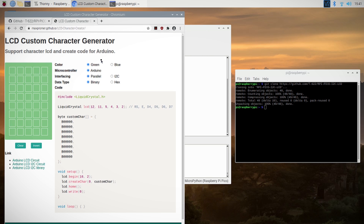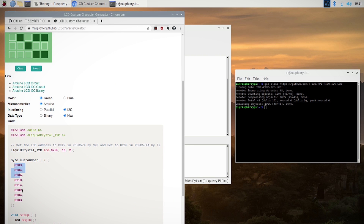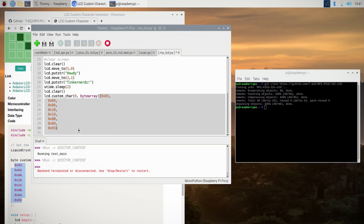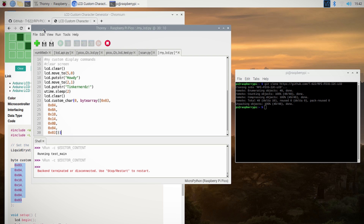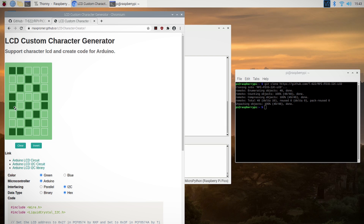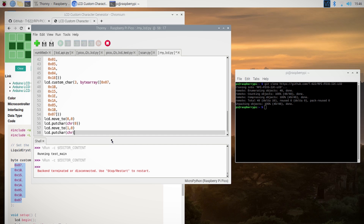Perfecto! But what if you want to display more than just text characters — what if you want to draw your own characters on the screen? There's a cool utility online called the LCD custom character generator that lets you draw your own custom characters. I'm going to draw half a smiley face, and it outputs the code for that character. Make sure your code is set to hex, then copy those hex characters. Back in our program we use the custom_char command, assign it a number value, and use a bytearray to store the hex values. I'm going to invert this character, copy the hex values, and store them as another character, then repeat these steps for the second half of the smiley faces. Now I can move the cursor where I want the first character and use the put_char command with the assigned character number. Testing it out — I've now created my own custom characters.